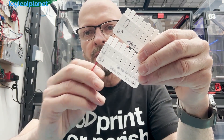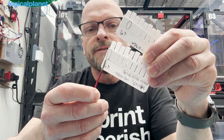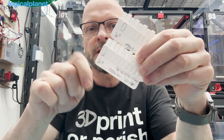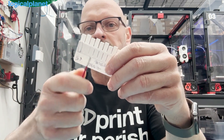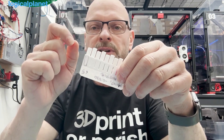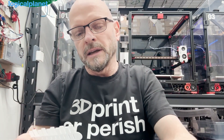Now with this setting I've got a 0.1 millimeter slot open, which effectively means zero squish — no flare-out at all. If you put a caliper on the tab, which is 0.2 millimeters thick, I'm getting a perfectly 0.2 millimeter layer height. Now I'm printing perfectly adjusted to the bed. With PETG especially, I had accepted it was never going to be as clean as PLA or ABS, but that wasn't the case — I just needed to get my settings right, and now my PETG is printing fantastically.